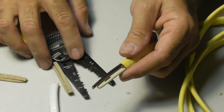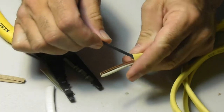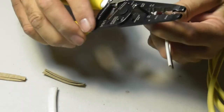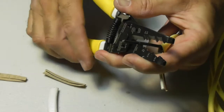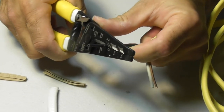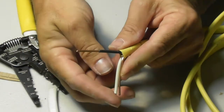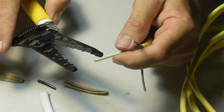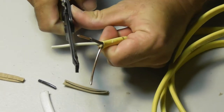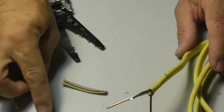So now we've got the stripping — the 12 and the 14. This 12-gauge wire is so thick and very difficult to work with. The number 12 is on the bottom hole, so I'm going to go with the bottom hole. Squeeze the handle down, numbers facing away from me. Look at that — nice and clean. Absolutely no damage to the wire at all. Going back down for a second pass, second slot, number 12, squeeze the handle, barely squeezing it — pulling — nice, clean cut. If you like my videos, please do a thumbs up and subscribe.